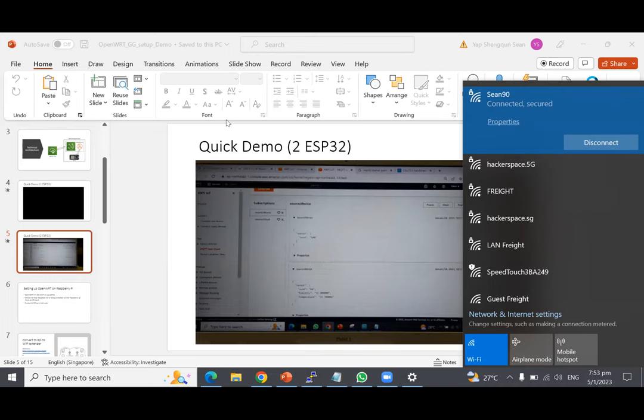So in a scenario where you are in a building where there's Wi-Fi and there's wireless sensors, one use case you can possibly come up with is you have a quick extender to connect to the wireless sensors that will upload directly to the cloud. But ESP32 already has Wi-Fi, right? Yes, but it's a good way to collect all the data together. There are plenty of ways people do these kinds of things. Just that for this case there's a specific requirement to use AWS Greengrass on the gateway itself, so this is a very good function to collate all your sensor data, which could be on ESP32 already.